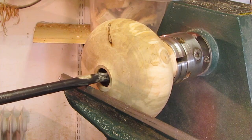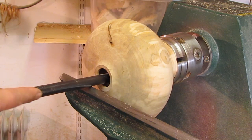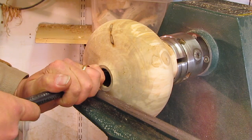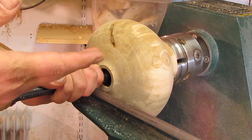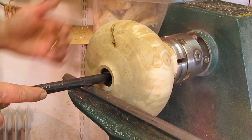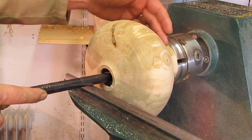I rotate the tool 45 degrees, then go in gently until I pick up the cut, then move my body in an arc and the cut will come off as I go across the hole. I can move my body forward slightly and cut back out, continuing until the cut goes all the way across to the centre — at which point I know I'm at depth. The grain is running with the spindle axis, so the main cut is going to be from inside out towards the shoulder, but I can run the cutter in the opposite direction just to maintain contact with the wood so I know when to move in and take the next cut.